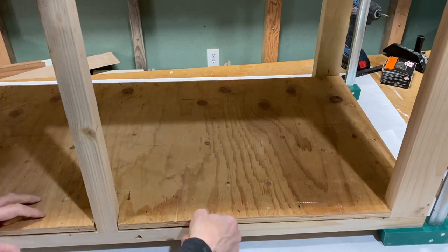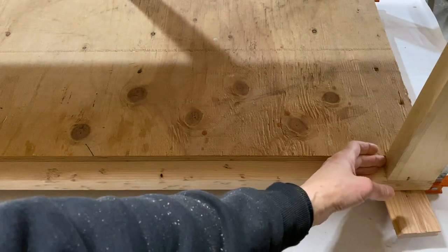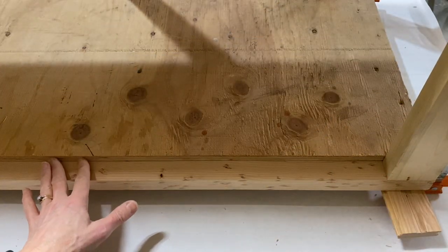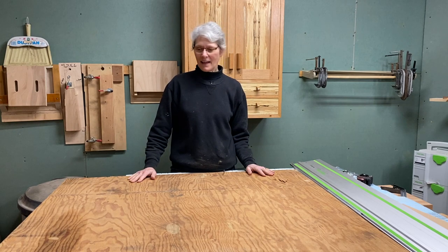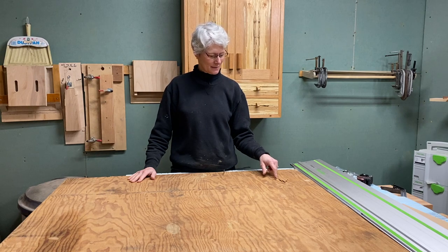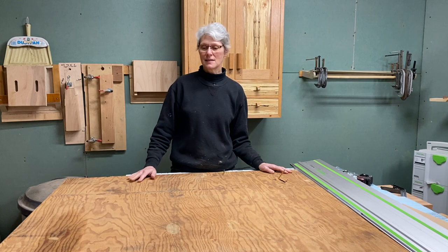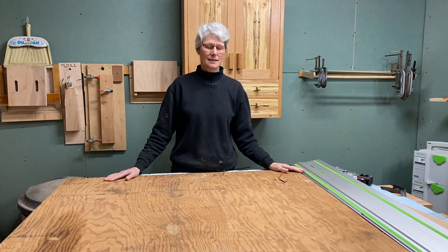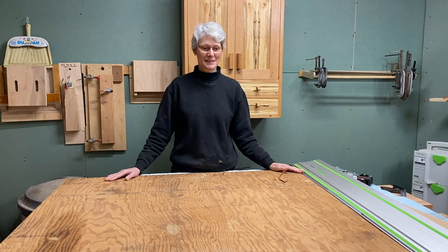I've also notched the back to fit in place. On the front edge of the box, I've left the shelf set back from the sides so that if I decide to put a set of doors on later on, it'll butt up against that back piece and seal things up well. This is for the back of the cart, and I'm using scrap materials. This plywood has some pretty serious holes in it - we're able to avoid those, but that means the direction of the grain is going to be going sideways. Traditionally it should go up and down, but it's the back - it's a shop cart. We're being resourceful and cutting it using our track saw.